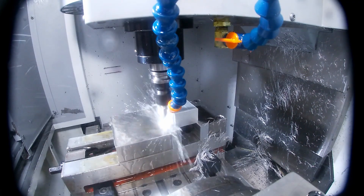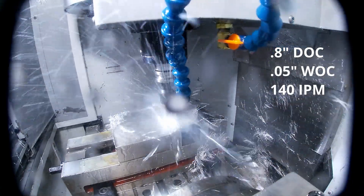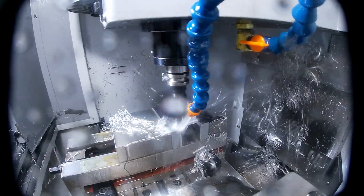Next, I ordered some material that was thicker — I think it was one inch by 1.5 inches — so that I would have plenty of clearance. But I was still going to trochoidal mill. This time I was using full depth of cut with a width of cut of about 50 thousandths of an inch. According to G-Wizard, that would have been fine. As you can see from the milling, I'm getting really good chip removal — it's actually pretty cool. But what I didn't realize at the time is that the end mill was pulling out as well.